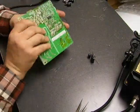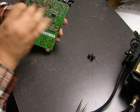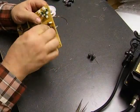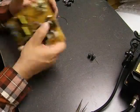What I'm doing on the back side is that as I'm inserting the capacitors, I am separating the leads out so that the capacitors will stay in the board until we're ready to do the soldering. So you just work your way around through the capacitors one by one.